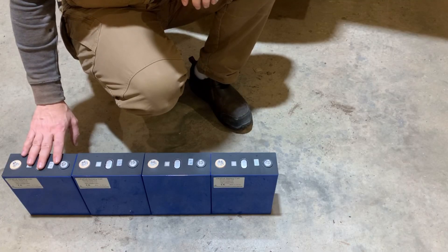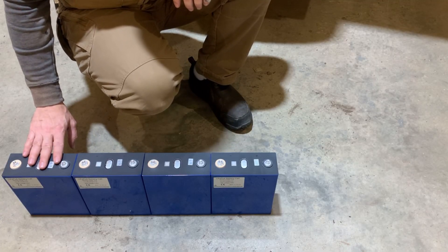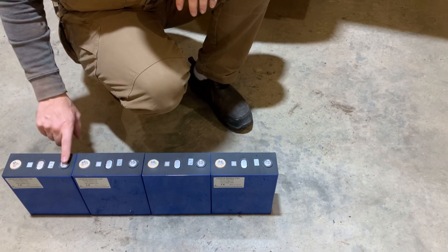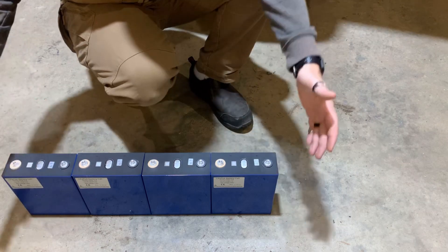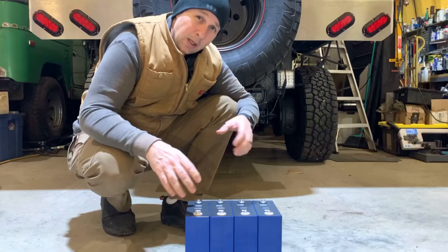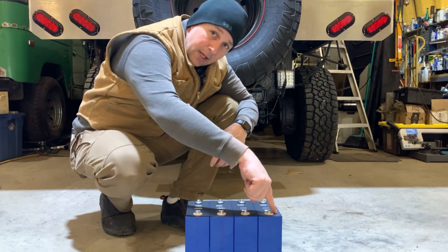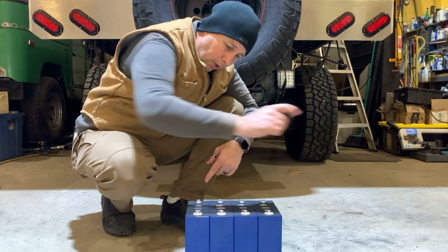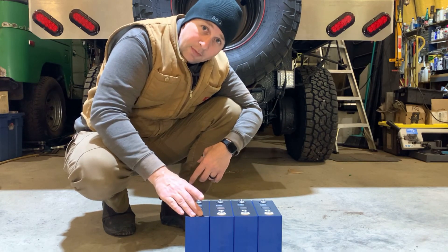Batteries are a collection of individual cells linked together in parallel or series. Each of these cells has a natural charged voltage of about 3.65 volts. So if you imagine traveling through the circuit entering here and exiting here, you will have a difference of 3.65 volts. Put four together and you now have 14.6 volts — that's series. If we rearrange the circuit so all the negatives are together and all the positives are together, you don't need to travel through every single battery — you maintain 3.65 volts but the capacity increases. If you put cells in series, voltage increases; if you put cells in parallel, capacity increases.